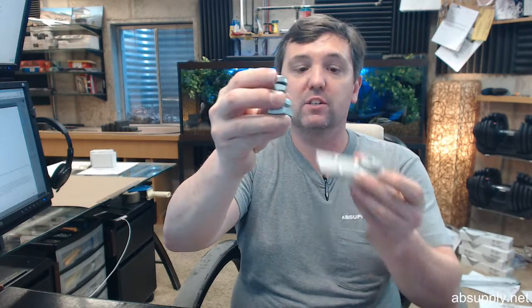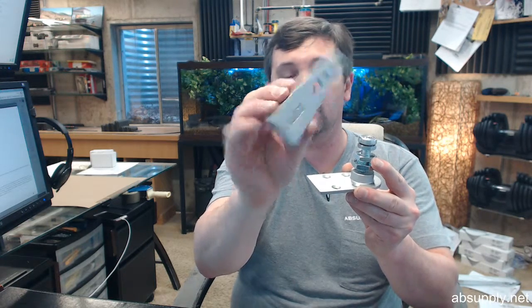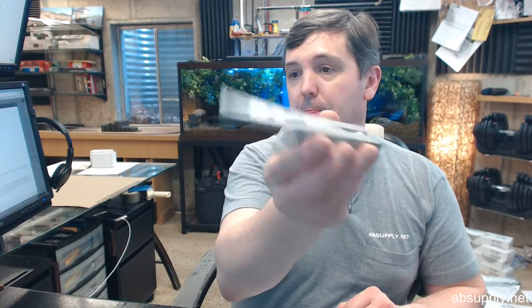All of the math of the adjustability of this ball bearing spindle, the floor plate if it's used, along with the bottom arm, is meant for a 1 inch inverted bottom channel. 200-pound capacity, that's certainly going to be well within the range of aluminum doors, and allows a 3/16 of an inch height adjustment, to allow you to accommodate what's going to happen with the door and frame. In the aluminum finish, obviously. Well, that's not exposed, but this portion is exposed.